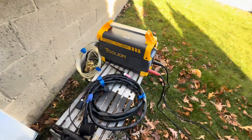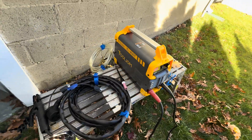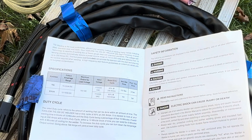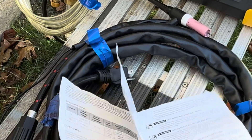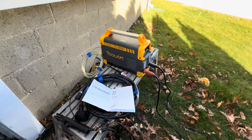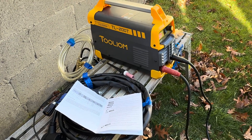It's very light — 13 pounds, totally maneuverable, gets in and out of tough spots. Here's your manual: duty cycle is 60% at 200 amps on the TIG, and 60% at 155 amps on the stick — both are good. I have never hit the duty cycle on this. I was thoroughly impressed with how this welded for $160. It's one of my favorite machines and by far the cheapest.